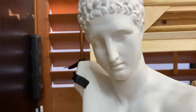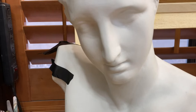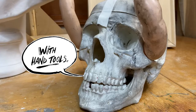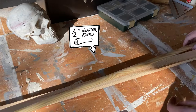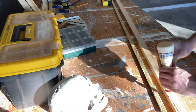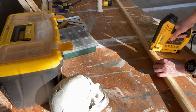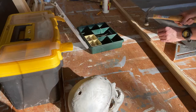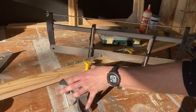The Academy has informed us that the finest structures were built without power tools. Without the aid of a table saw, we will need a piece of pre-milled quarter round to give us that beveled edge — glued and nailed to another 1x2 board. Either 1.5-inch or 3.25-inch quarter round creates a great rounded beveled edge, and the best part is you don't have to mill it. To fix the boards together, we will glue and nail following the same procedures as before, joining eight-foot sections together. Remember to nail every five to six inches with either the brad nailer or your hammer and one-inch finishing nails.